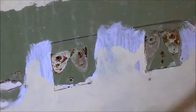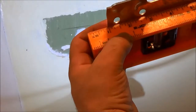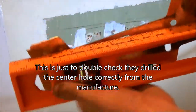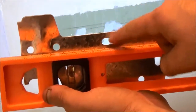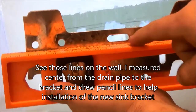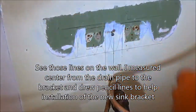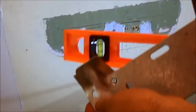We're going to grab our ruler and measure between the two dashes. By doing this I can confirm that this hole here is perfectly centered — I've confirmed from edge to edge that this is the halfway point — so they drilled this hole properly. I don't need to worry about edge measurements; I can just focus on center. As long as I match it with the line on the wall, I'll be absolutely perfectly centered when I put this bracket in.